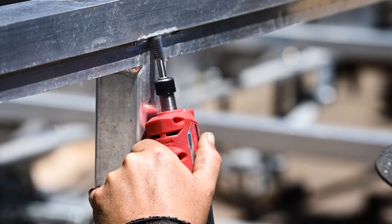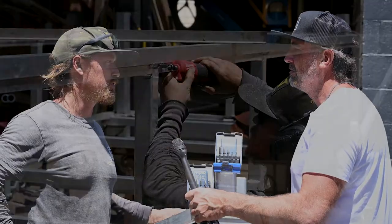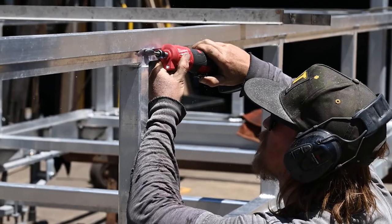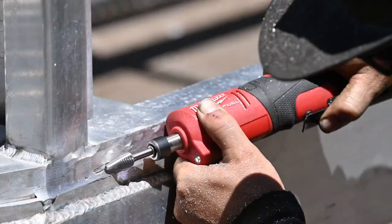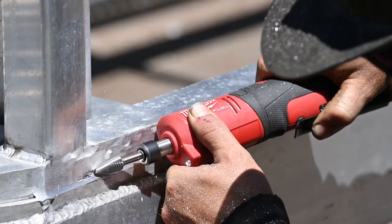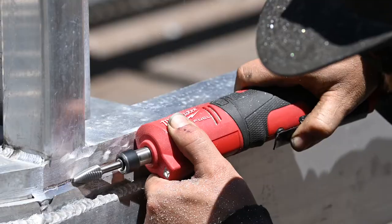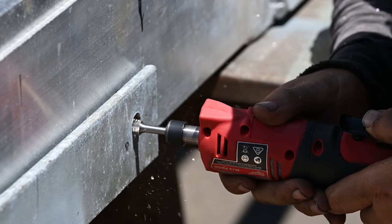As for the C3 Plus, they've been the same - really smooth. You just change between the two depending on what you're doing. If you're facing, milling, moving welds, working seams, whatever the situation you're in, there's kind of a tool to suit every job in the packs. And for deburring holes, if things aren't lining up properly, they move material so quickly - you can just come through, take your edges off, and you've got perfectly lining up holes between two things.